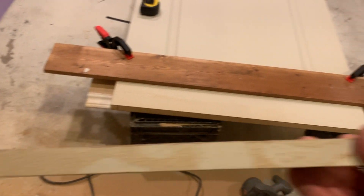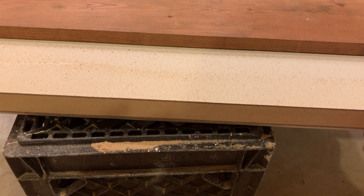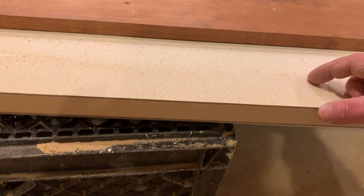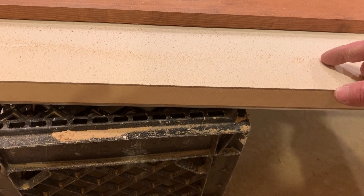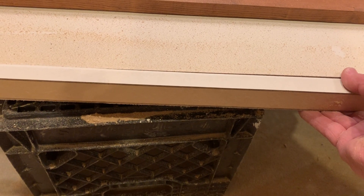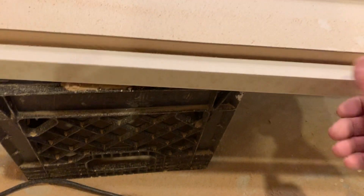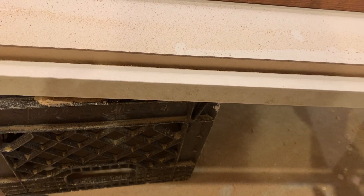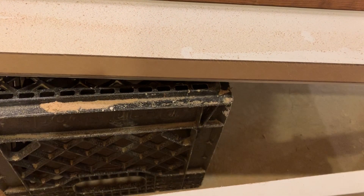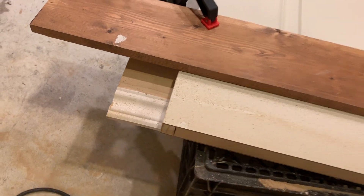Perfect cut — you can see the plug that I ripped off. Now these are solid doors. Had this been a hollow core door, inside here would be hollow. They used to make doors where there'd be an inch and a half block at the bottom so you could cut an inch off and still be okay, but now they've reduced the size of the plug, so you have to re-plug the door. You run the cut piece through a table saw, shave each side off, slip the plug back into the door, glue it, pin nail it or clamp it overnight, and re-block the bottom. Very important on bi-fold doors — without it you won't have pin support at the corners.